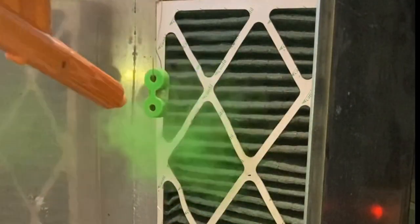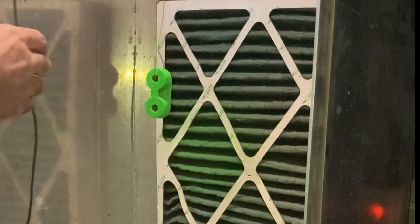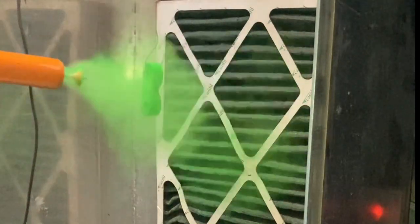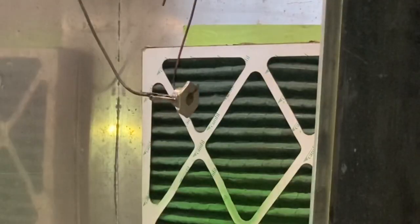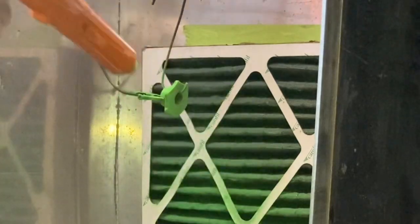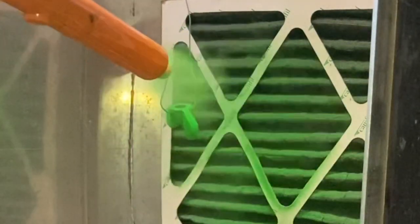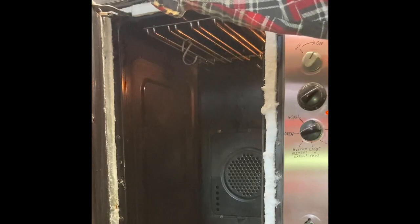So now all the smoothing out is done, it's time to powder coat. This is John Deere green — it's a fairly bright green. Looks horrendous like this but it's not so bad once it comes out. My oven for powder coating is a standard 900-millimetre wide oven. I've just tipped it on its side because I find height is an issue with bigger items rather than the width. I took all the hot plates off it and just used the oven — got it at the junk shop for about 20 bucks. Does the job perfectly.